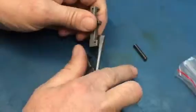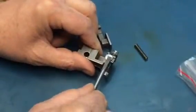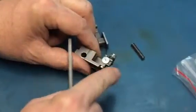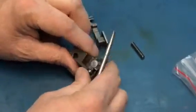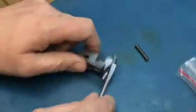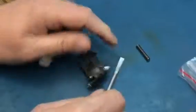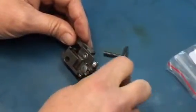Now you get a fresh cutting edge if it hasn't already been flipped. Loosen that screw, this button. You can rotate it 90 degrees and use it again, and you keep rotating it till it's dull. Alright, so now that you've changed your blades or rotated them, you leave this screw loose, the button's loose, and put this back on the machine or on the thing without the spring.